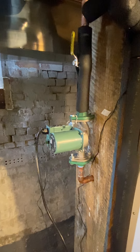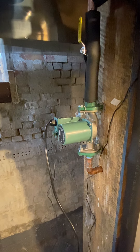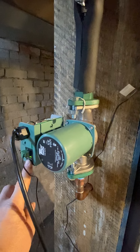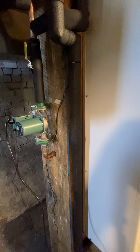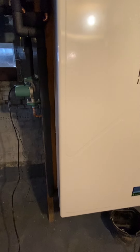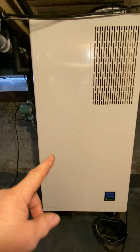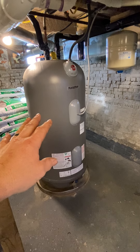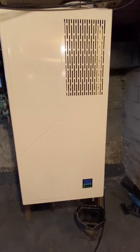It has a smart option. Currently it is cycling — it's set to cycle once every 150 seconds, so it runs every seven minutes. That's what they call a pulse. Eventually this will be set to smart mode, where the sensor inside the return line will look at the temperature and cycle based on the needs of the house. I may leave it on this cycle or go to smart — I don't know — because my goal is not necessarily having hot water at all the faucets. The goal is to have what's coming from this heat pump tank fill the Marathon tank and store. This thing had only run less than 10 minutes and brought everything up to temperature.